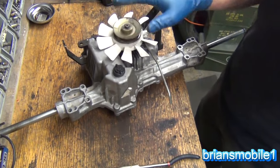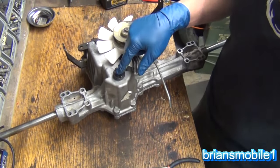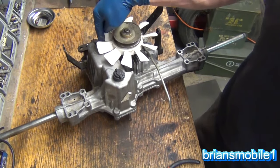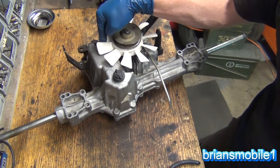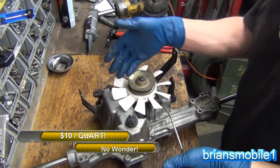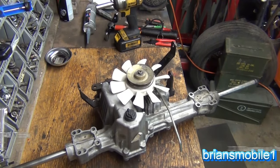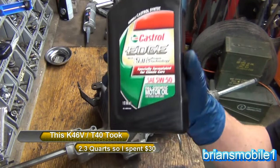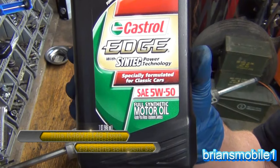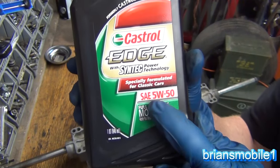From the top, this is your pulley — the drive pulley or input pulley. This is your vent cap, filler cap, or drain cap if you're going to attempt to change the fluid. Now, from John Deere they put poor-quality oil in this and that's what blows them up. Tough Torque recommends using a synthetic 5w50 — they've got their own special brew but basically anything labeled 5w50.